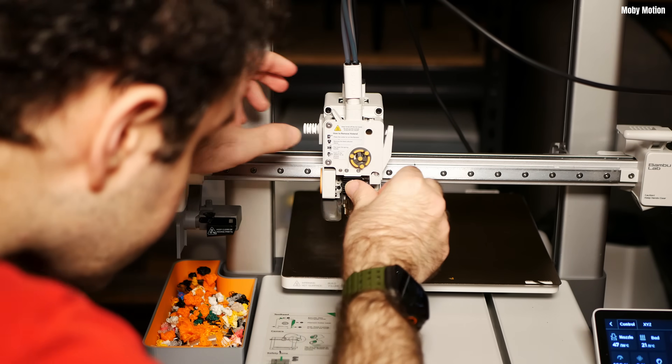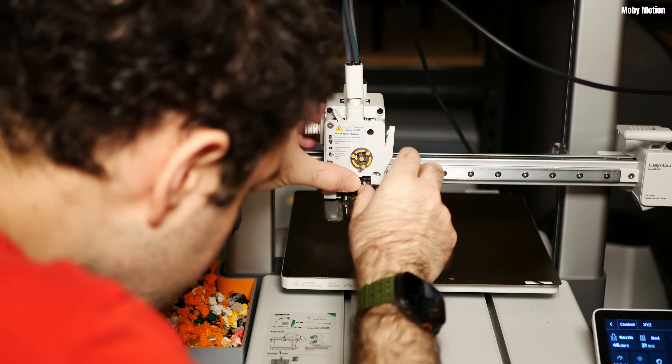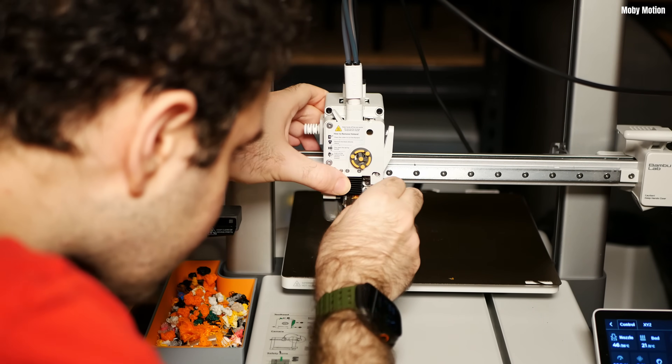I got really far and reached a point where I thought I had cured it — I thought I'd got all the plastic off and couldn't wait to put the nozzle back on and get printing. But I couldn't get the nozzle on. It felt and looked like it was in place but I couldn't quite close the clasps, which told me it must be misaligned. I tried a new nozzle — the stock non-hardened steel one that came with the printer — but that also didn't fit, which at least helped me narrow down the problem.